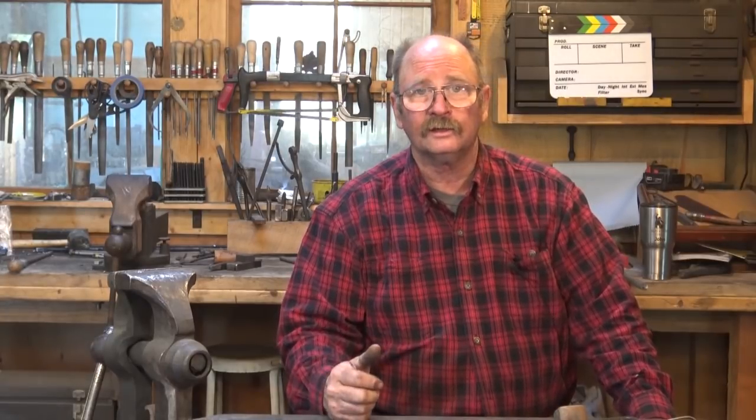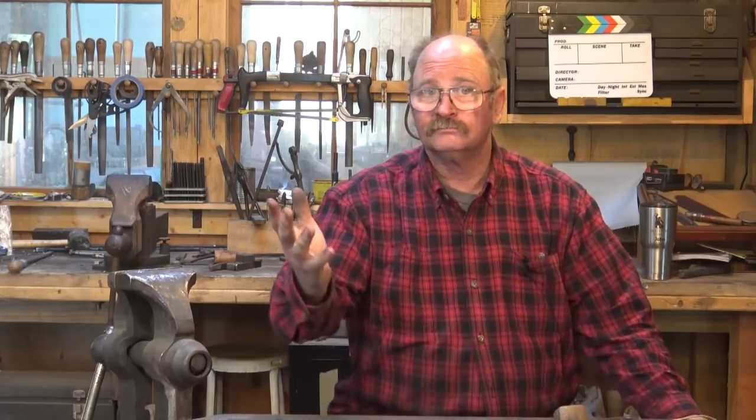There are other fullers that are often used in the shop — I mentioned the guillotine tool, spring fullers, fullering jigs, things like that. We've made some of those, and I'll link to the fabricated fullering jig so that you can see how that works. We'll look at a lot of those tools as part of the tool of the day, to see the variety of other fullering tools out there — guillotine tools, fullering jigs, spring fullers, and maybe fullers that go into the fly press when we get to fly press tools. Lots of different options, but the concept is always the same: it's a convex surface that makes a dent. Pretty simple.